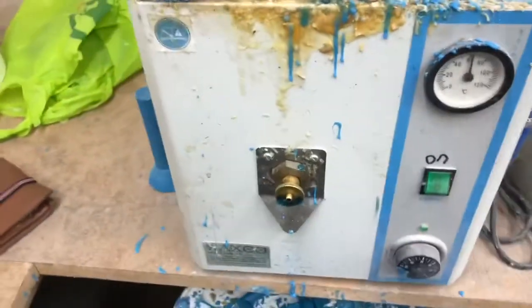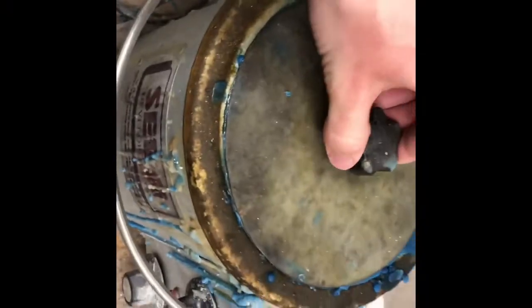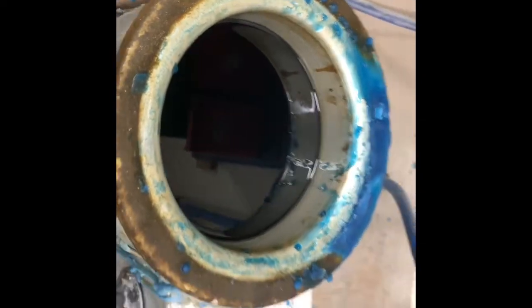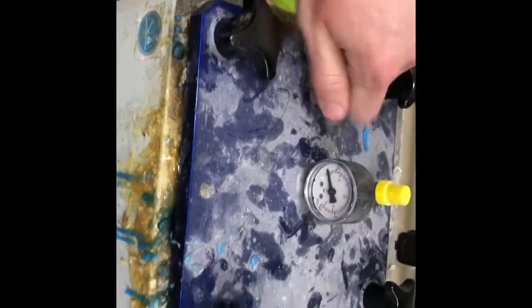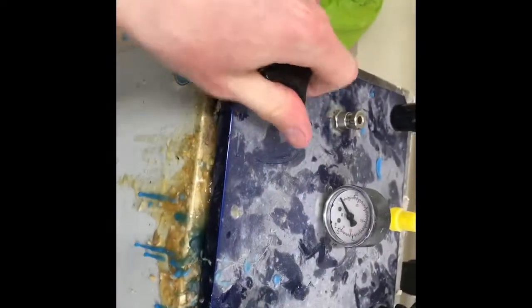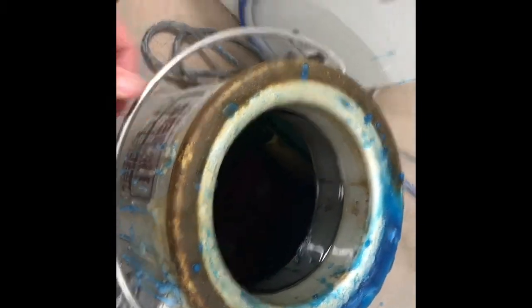Here we have the wax injector — as you can see, I push that nozzle and liquid wax comes out. To turn the wax into liquid form we melt it in this pot. These are the bags of wax that we get, so that will go into the pot at 50 degrees and melt into liquid. To fill the wax injector up I'll take this lid off and pour the wax into it — as you can see it is empty. I'll pour the liquid wax I've melted in the pot into the wax injector — I'm not going to do it one-handed because that would be a disaster.